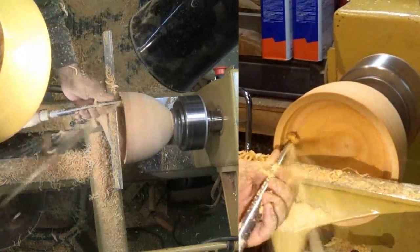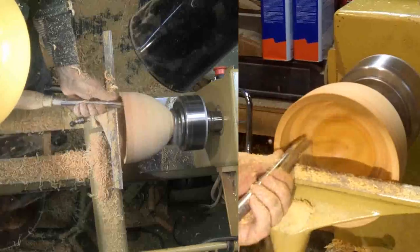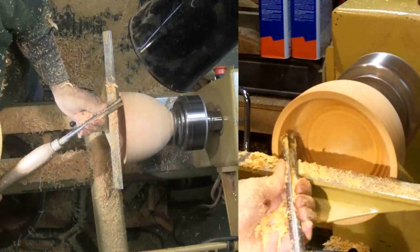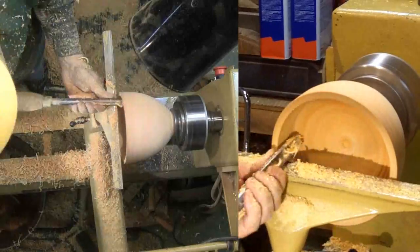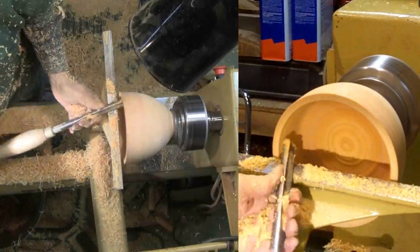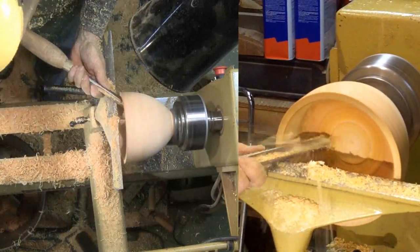Near the lip, the trick is to keep the bevel of the gouge exactly parallel to the outer profile and the flute closed, meaning the two opposite edges are exactly vertical. My thumb positions the gouge. After starting the cut, then the flute can be opened a little.